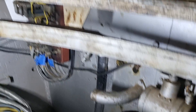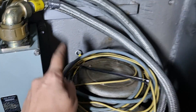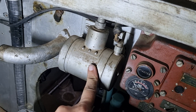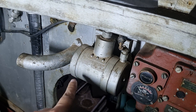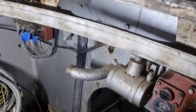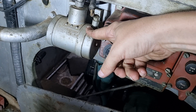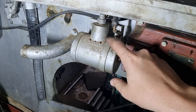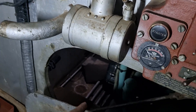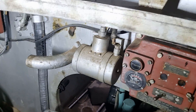Interestingly, on one of the wires, it actually plugs into the booster coil, which is really strange. I haven't quite figured that one out yet, but I have an idea it's got something to do with when the starter button is pressed, because this only operates when the ignition is on. We don't actually use the booster coil — it's just our running philosophy that if you need a booster, at least in this climate, the engine probably isn't set up correctly. So we've never run a Centurion with the booster coil — they have them installed but we just unplug them, because that way you know the tank is working lovely. Should start without a booster coil. That's just my philosophy — feel free to argue with me.